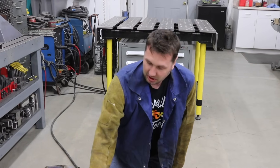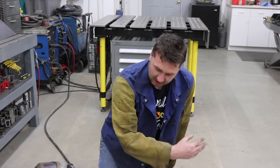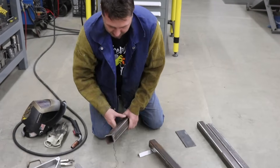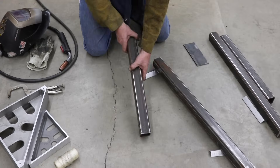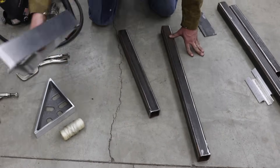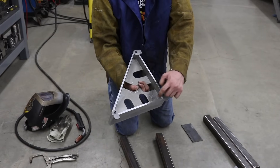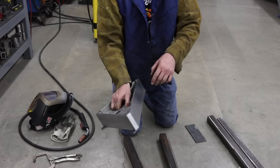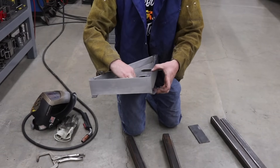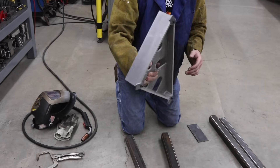I want to use the fireball squares to do the same thing without any angle iron, any flat plate. By eliminating this, we don't need that, we don't need this, we don't need this. This square has everything built in all at once. Here's our three points. Here's our perfect 90. These two surfaces are tall and three-dimensional, so it takes care of the roll, all at the same time.